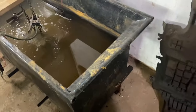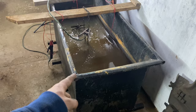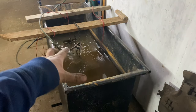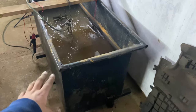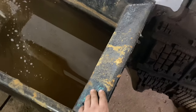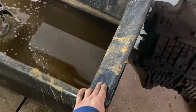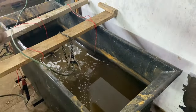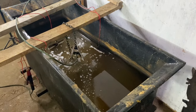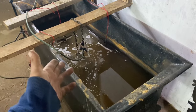That is as easy as electrolysis is. I made this bath for it — everyone says you can't use a steel bath, but I do. I made the steel bath so I can dip my anvils. What I did is I had it bin lined with that polyurethane spray rubber stuff — the stuff you put in your pickup bed. I had the whole inside of mine sprayed with that so it's non-conductive. And it works perfectly.